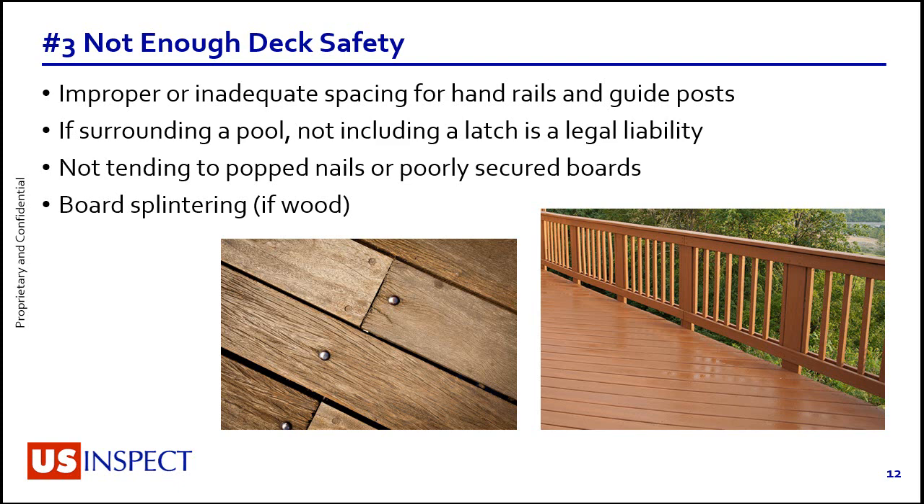When pressure washing, you always want to keep the nozzle six to eight, maybe even ten inches off the surface of the deck so that you only remove the outer micron — just the little skin on the outside — so that when you put your stain on, it bonds uniformly. The deck on the right in the picture will last longer because of a full-bodied or colored stain, which provides a much better barrier against the sun's rays penetrating into the wood than a clear wood finish like the one used on the deck on the left.